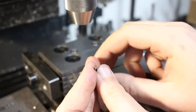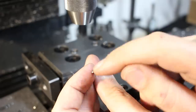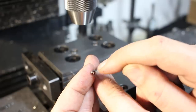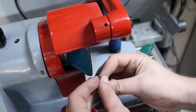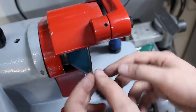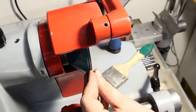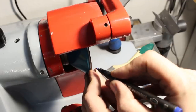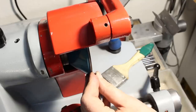Let's resharpen the drill again. I did a normal regrind as usual, and now I'm going to split the point — that will make the drill cut this material way easier. Splitting the point is really hard to show. I'm using my diamond wheel on the D-bit grinder, completely offhand. The idea is to grind with the edge of the grinding wheel into the chisel edge and reduce the chisel edge by a lot.